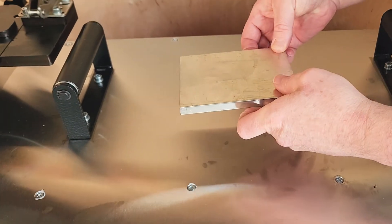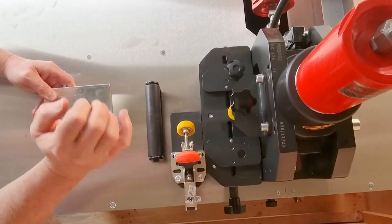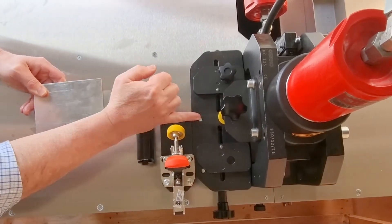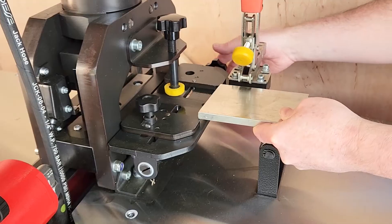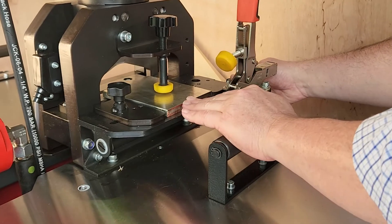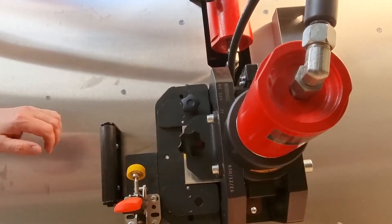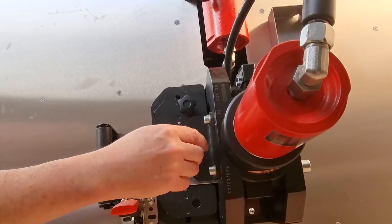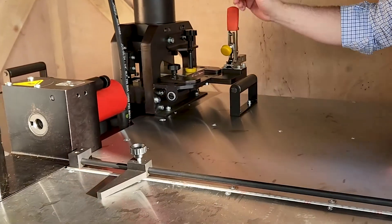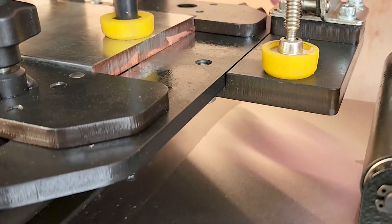Let's have a look at the cutting feature of this bus bar machine. On the side here we've got a knob and these adjust the two side guides. So if we're cutting a piece of bus bar 100mm wide, we'll want to go 50mm out from the center. As you put your bus bar in, roll it in and let it go all the way through into the cutting section, and then just slightly nip it up on the knob. This here is a hold-down knob as well, and that stops — when you complete your cut — that stops the bus bar springing back up. When you've got a hold length and it's coming out on these two rollers, you would literally clamp down like that.